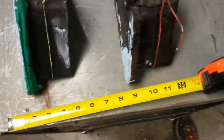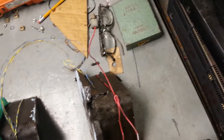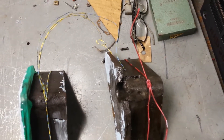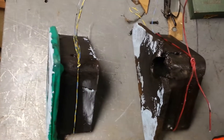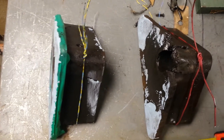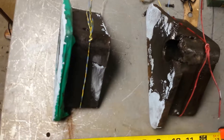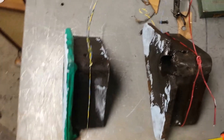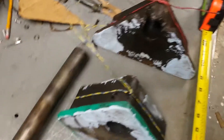Today I am documenting the repair of the Terramite T2 swing assembly. The swing, which goes left to right, passes through the rear of the machine via a large angle iron — probably a ten-inch piece — welded to the back vertically. Two pieces fit into the bottom and top of that assembly, with a pin going between them that holds the swing assembly.